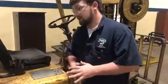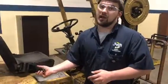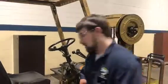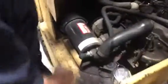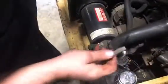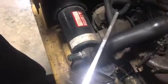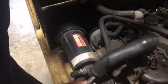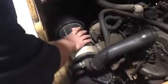And that comes to the point where the seatbelt needs to be on, and you need to stay within the cage. It'll save your life. While you're on this side, lift the hatch or the engine hood back up. This side, you want to check the hydraulics line, which looks like it's right on the full mark and it's clear, so that's good. Your air filter is right here. You would pop that off, pull the air filter out, check it.